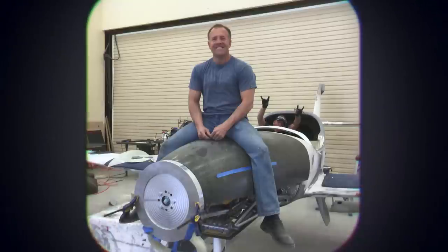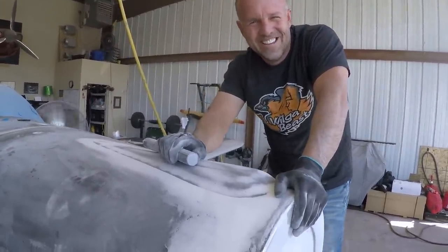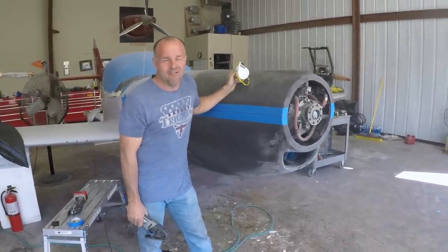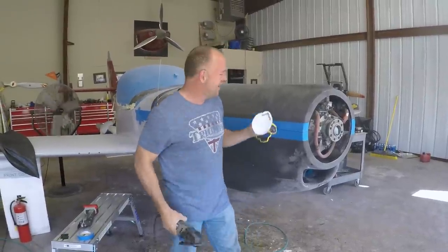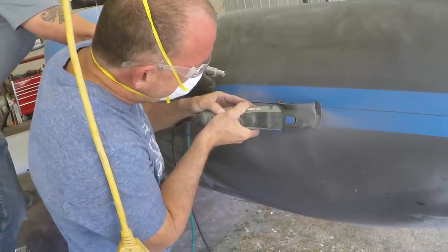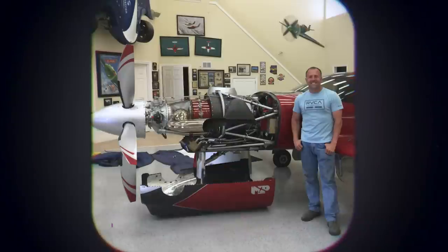The start of a cowling is bits and pieces of cardboard and rulers around the shop until it works on the engineering side and then works cosmetically. We're getting there — we got about 10 billion hours left of sanding to do. It's been a long couple of weeks. This is a one-of-a-kind cowling; it was a lot of work. There's a whole bunch of mini molds on molds. We literally built the whole cowling right on the engine and worked our way outward, but we finally got there. We're ready to cut it off. It's the hardest part, the one-off part, but it is so much fun.